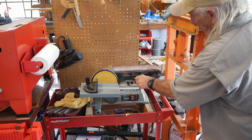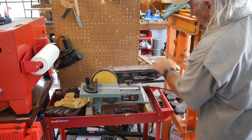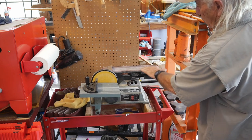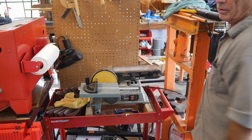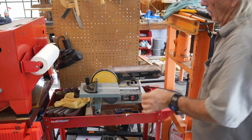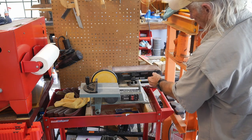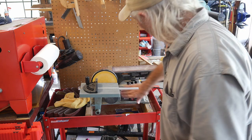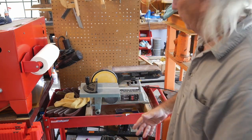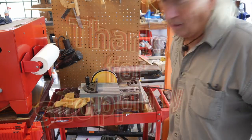The belt change is so easy it is absolutely amazing. All you have to do is pull this lever back, lock it, slide your belt off, slide your new belt on, bring this back. This knob is your fine tuner to get the belt to stay in the center when it's running — it'll only change a little bit under load conditions. That's about as much as I can say about the Delta belt and disc sander today. Thank you for watching Coffee and Tools and thank you for subscribing — we'll see you next week with another cool project. Adios.